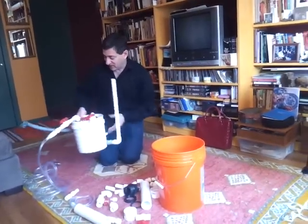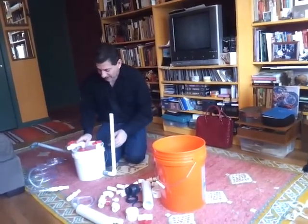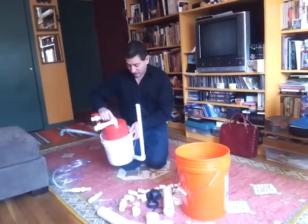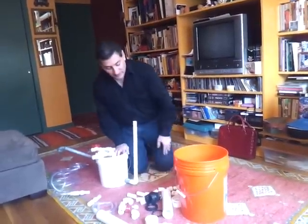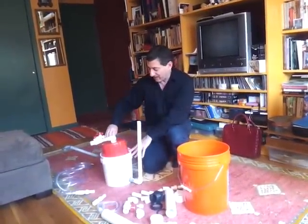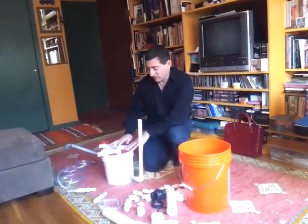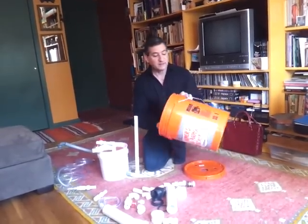That's the basic ARTI-style digester we've been building around the world. You can do this at home. Now, if you're in a cold climate where it will freeze in winter, since the open bucket is exposed to the elements, the water will eventually freeze. So instead, we build an indoor or outdoor insulated digester to attach to this, and let this serve mainly as the gas collector — filled with salt water or antifreeze — while the sealed digester does the actual digestion.